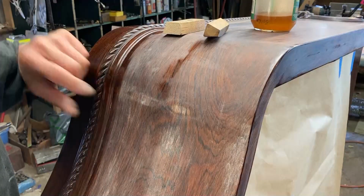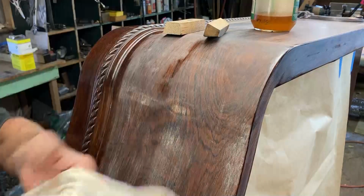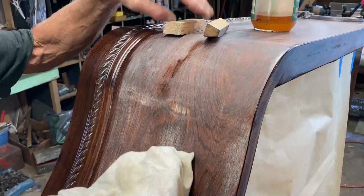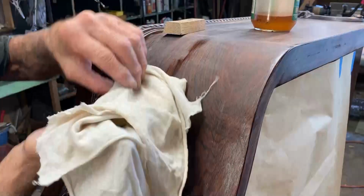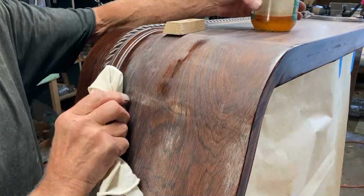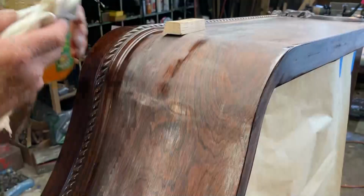The dust sticks in these pores here, so before we do any more polishing on this case, shellacking I mean, we're going to do this. Wrap a cloth, not too thick. We need a curved one in here, like so, so we can push this into the corner. Now we'll take our shellac mixture and pour some on here, and make sure that silica is stirred up in there.